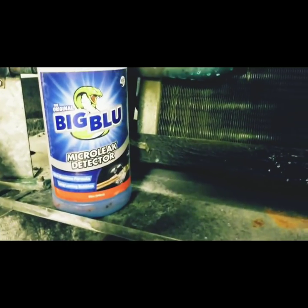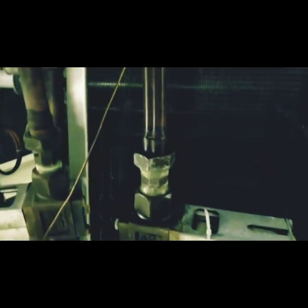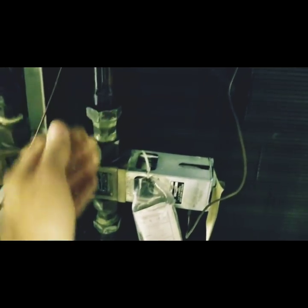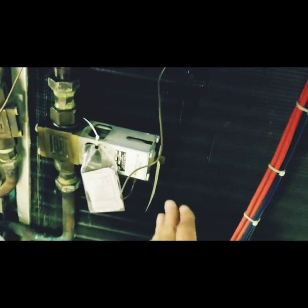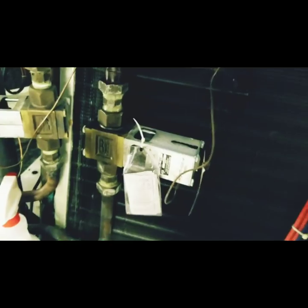I did pull out the big blue, but I'm not going to get to use it this time because my HVAC sixth sense kicked in. We've got all this oil around here. This is a water regulator — a pressure regulator on the water side of the system. It's water-cooled, so you have water flow through here and refrigerant pressure through this cap tube that maintains pressure on the high side of the system.